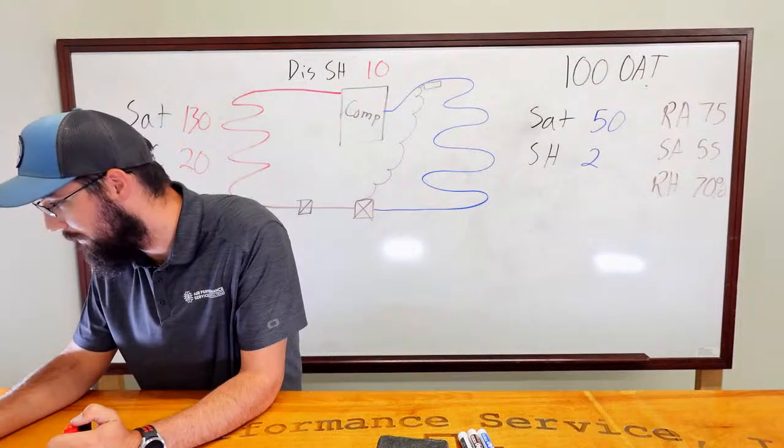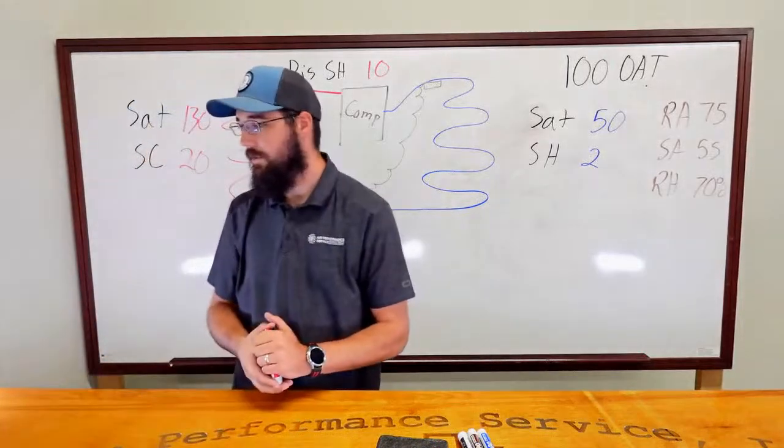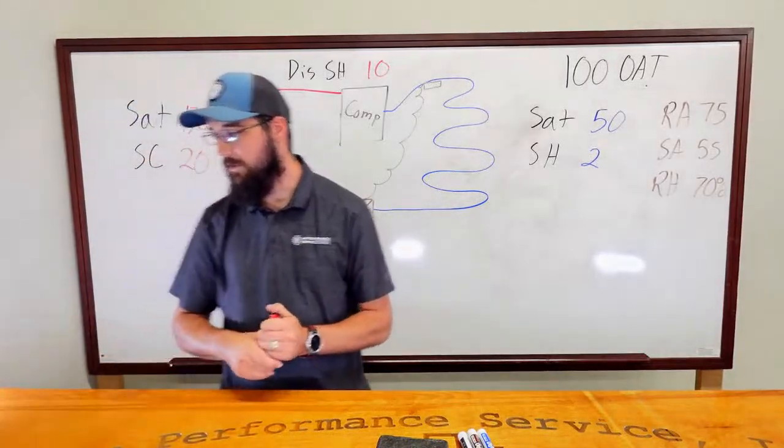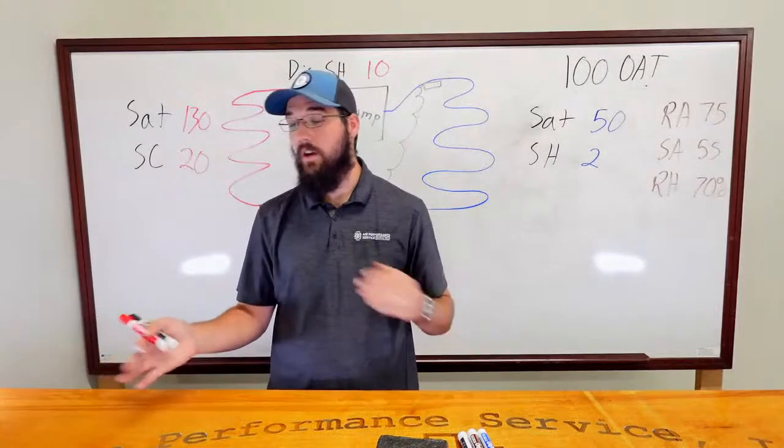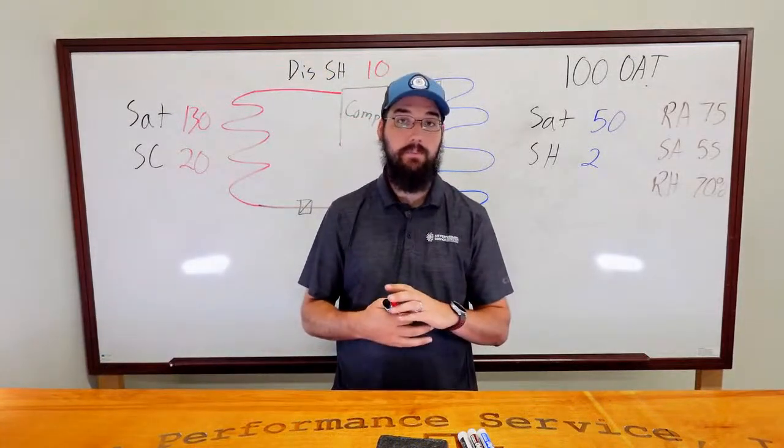All right, see, 20 degree delta means airflow is close to proper. There you go, Michael, good job. Okay, all right, Jason is lost. Yes, Michael, you're on that. Yeah, why are you lost? And that's okay. It's okay to be lost, right? Keep that in mind.